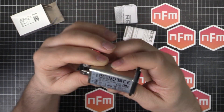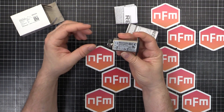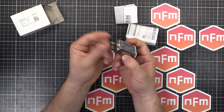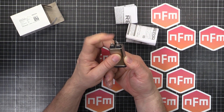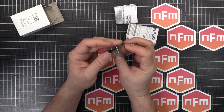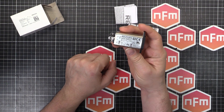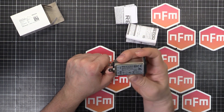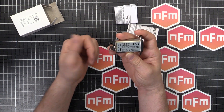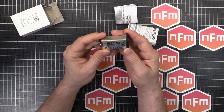This can greatly simplify the design of products, because rather than having to spin up a power supply or even have a separate one somewhere, it's all self-contained — just plonk that into your product and you've got 5V there. It uses standard connectors, so you've got to be careful if you ever find one of these in a product: be doubly sure you've looked at the labels, so you don't put in a straight-through version without the power supply, because you will pump mains voltage into the circuit, and that would be unfortunate.